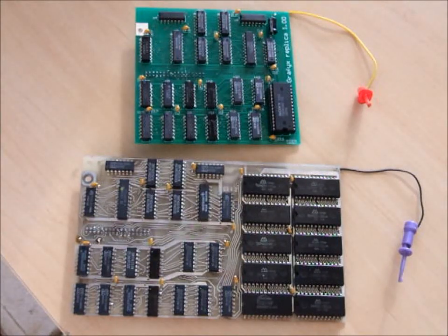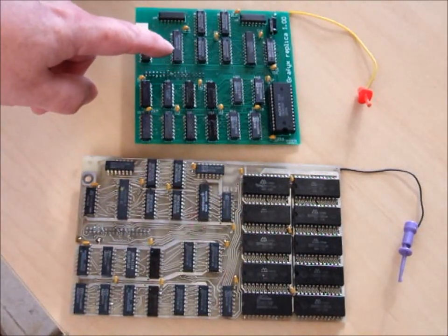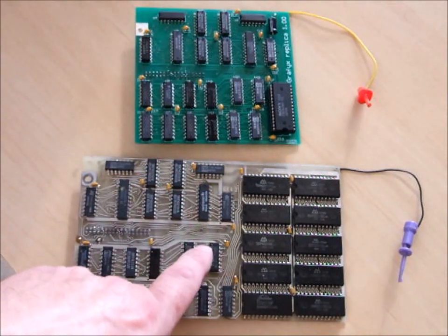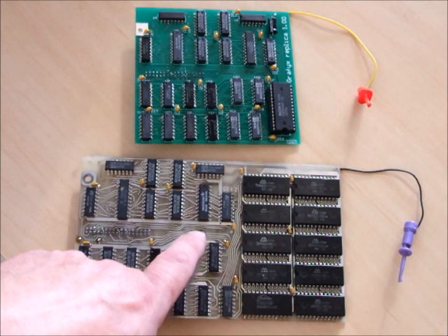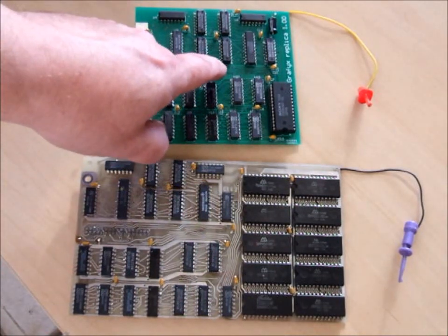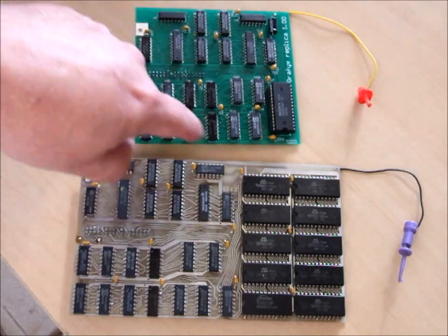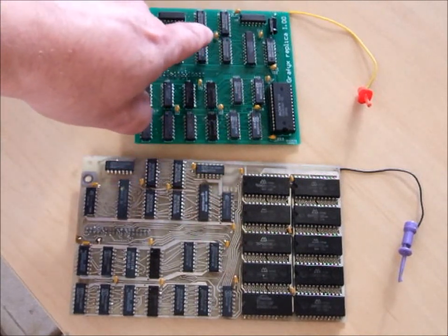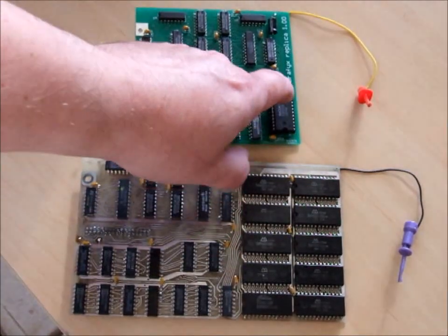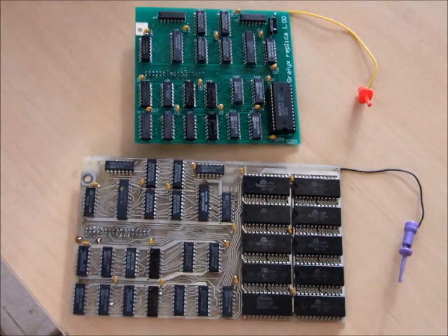Here's my latest product, a high resolution graphics board for the TRS-80 Model 4. It's based on the design of the original Grafyx Solution board, which hasn't been available since the 1980s. This one uses the same architecture as the Grafyx Solution board and reduced the 10 memory chips down to one chip. It's completely compatible with the Grafyx Solution board and is just as easy to install.